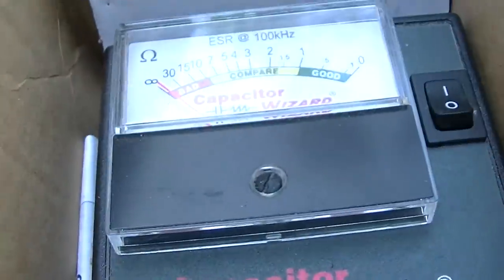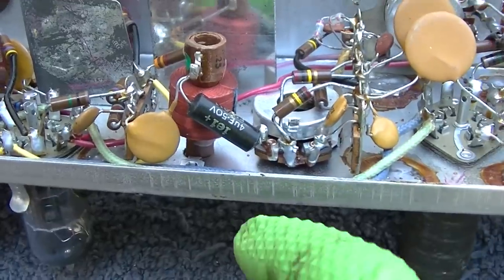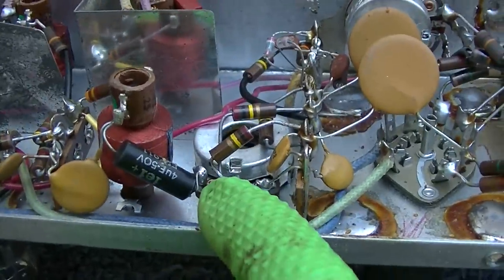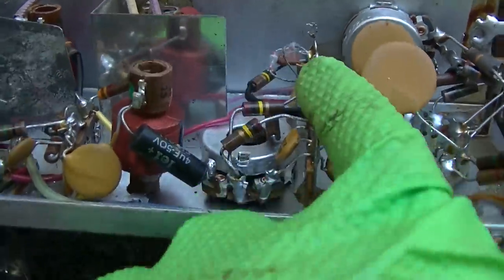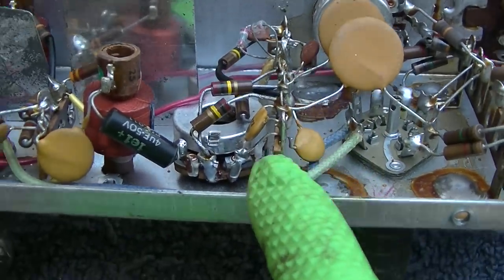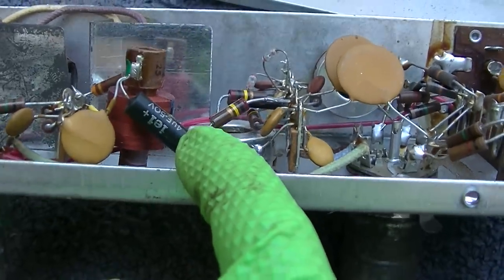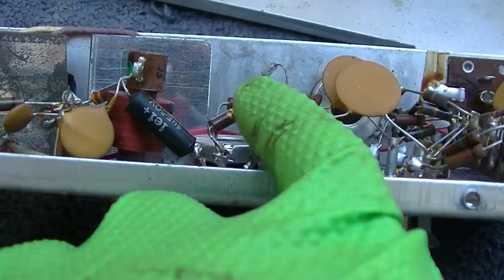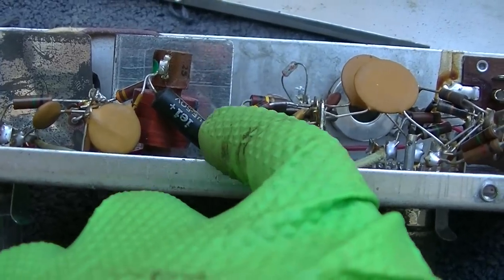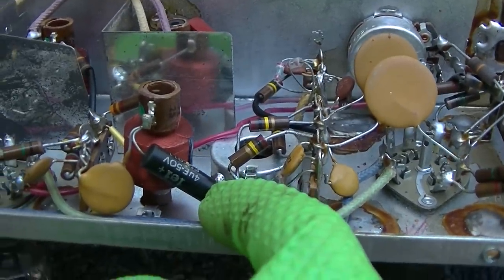Yeah, that capacitor is totally dead. This is probably where the monaural audio is fed through into the left and right, and then the decoded left-right difference is added in afterwards. That's why we weren't getting any monaural audio, it just sounded hollow, like it was only the stereo separation. Kind of like all chroma and no luminance on a TV, just all color with no black and white image behind it.